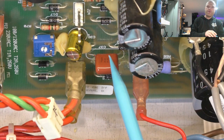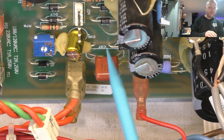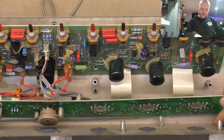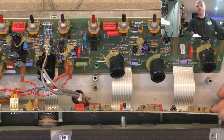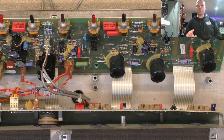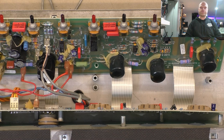So there's our new happy little C37 down there, ready to supply the bias supply without shorting to ground like the last one, hopefully. So now I've just got to repair that one standoff, which I removed. Stripped off, well, the screw actually. I'll just find a suitable screw and new nut and lock washer for that, just to replace the one that snapped. The Loctite was able to be cleaned off the other one, so they were able to be reused without being, you know, way too stiff.